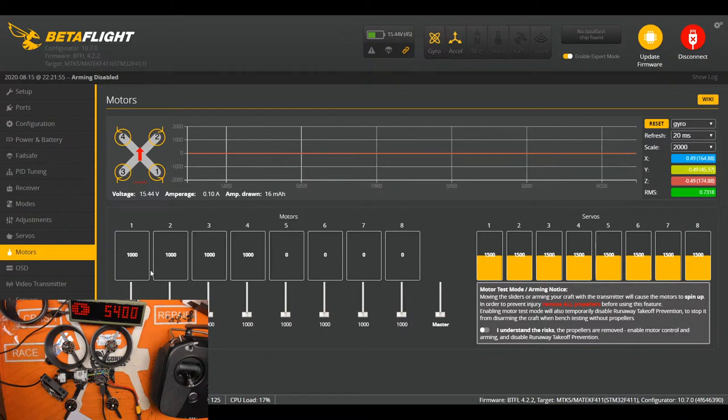What would you say is a safe core CPU, guys? When should I unplug, at what Celsius? I wouldn't worry about it. The warning element in Betaflight goes off way too early, and I'm pretty sure all the flight controllers will actually shut themselves off before they cook themselves. But the warning element comes on way too early. But that's just my own personal opinion there.